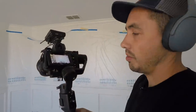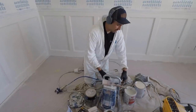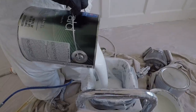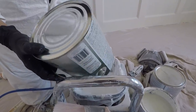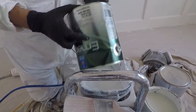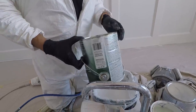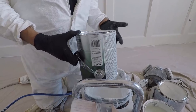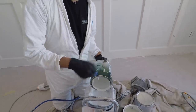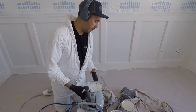So we'll switch over to the GoPro and I'll show you guys my setup and how I'm going to spray this. We're going to put our five gallon strainer — probably not going to use the whole thing on this project, but I always dump the whole gallon because as these things settle they kind of separate. You don't really get all the pigments and all the sheen that you need if you only dump a little bit in. You'd only get that if you mix it all up before you dump it in. This is just what I do, and I actually mix it up in here too.